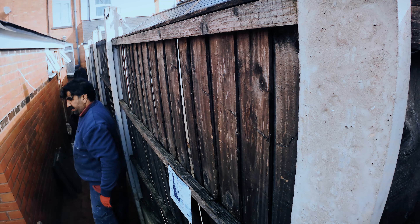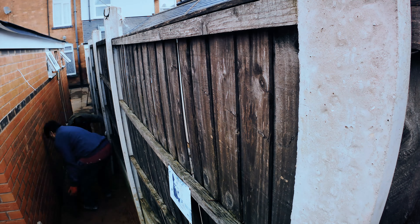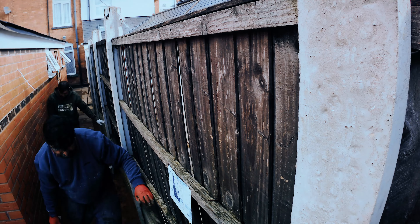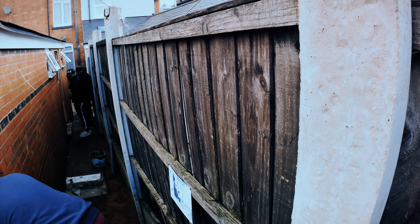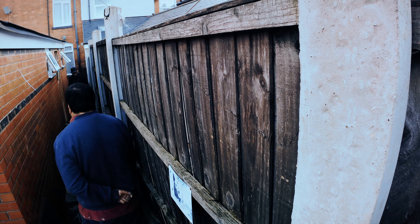What they're doing here is laying down each slab on the sand mix, making sure it's sloped down, then dropping a little bit of cement — they don't need to do this but they put a bit just to create some bondage between the slab and the floor to stop it moving about. Then they cut extra bits from the sides and put those along the gap on the wall. If you have a system like this it makes sure you don't have any damp issues.